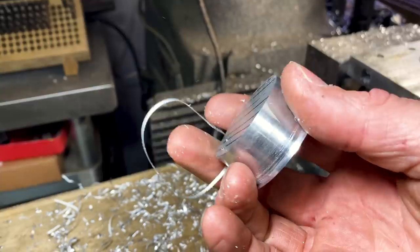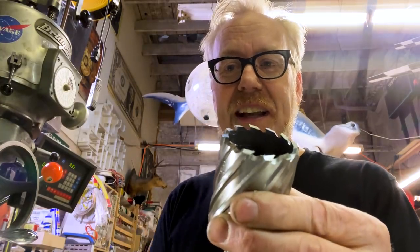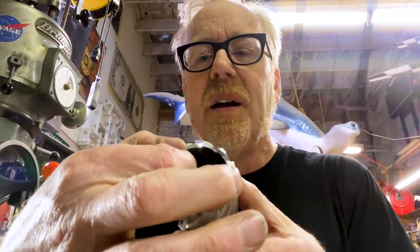So why is it so amazingly good? Why does it make that cut so cleanly and without any of the normal noise and fire and brimstone of using a big bit like this? Specifically because the annular cutter is actually moving and removing less material than a standard bit, even though it's cutting a much bigger hole. Here's the plug that came out — there is what the actual cutting did. A standard one-inch bit is cutting away a solid one-inch wide piece of aluminum — a lot of atoms to move. That is a lot of material to carve, and that is hard on a bit and hard on a machine; it creates a lot of heat, and that heat makes it worse.